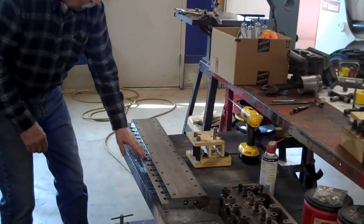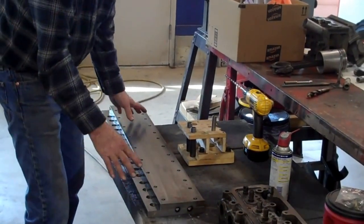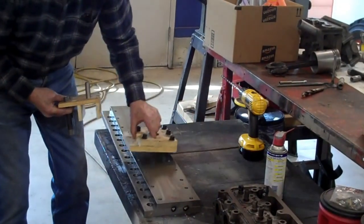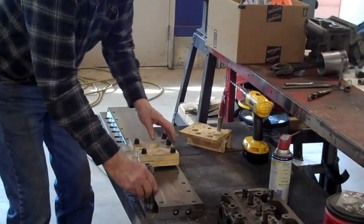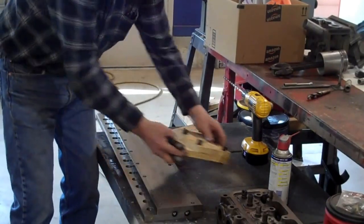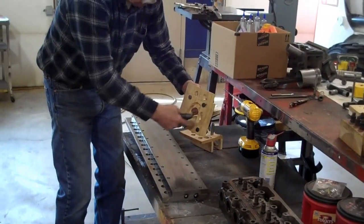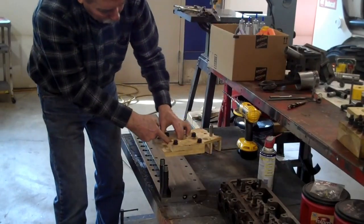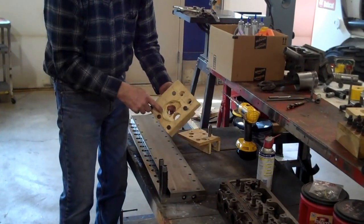This is the base plate and the second plate — I've tacked them together so that I can get all the holes drilled exactly the same for the head bolts. And that is actually these two plates here for the push rod holes, where these will come up to this second plate here. This plate here will have the valve seats in it, and the bottom plate will have the chamber hole. With this design, I'll be able to get a lot better angle on the spark plug too — right down through here — a more direct angle into the combustion chamber with the plugs.